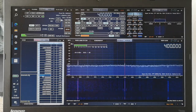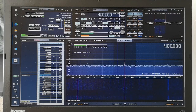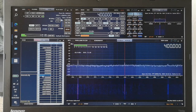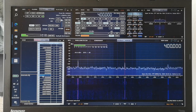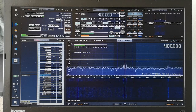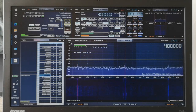Here's a steady view of the laptop screen. We're looking at 400 kHz — an NDB, non-directional beacon. I'll turn the sound on. Wait for it to send its call sign in CW. It sounded like NDW. So that's the beacon at 400 kHz. The noise floor, when the buzz stops, is around minus 115 dB. The signal is at about minus 98 dB, which doesn't sound like a lot, but what's important is signal-to-noise ratio, not absolute signal level.